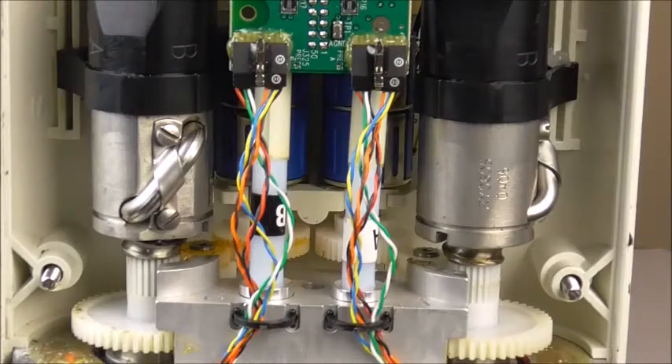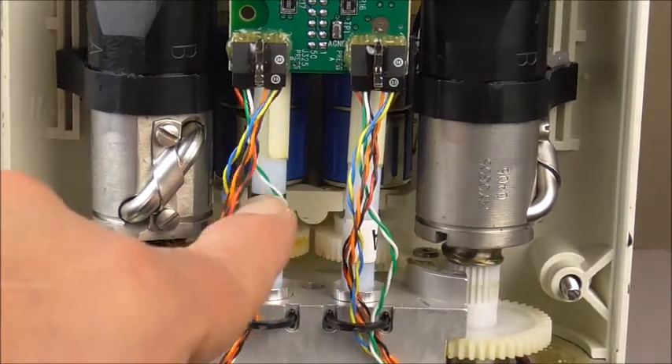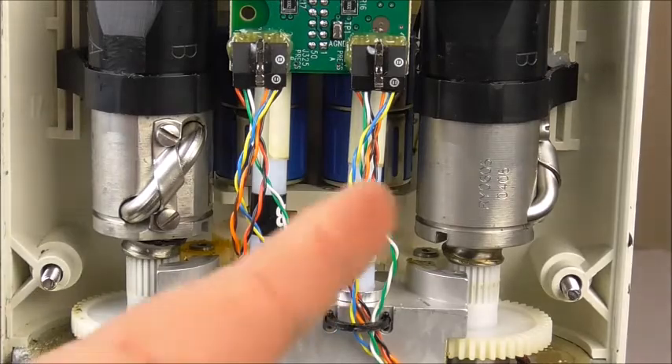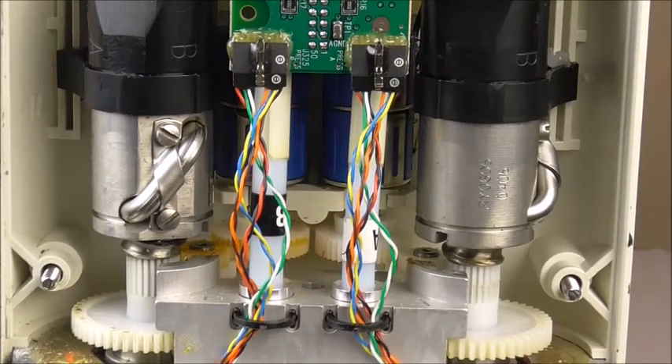Now what we're looking at right here — these are my two blue potentiometers behind my power drive cables here in the back. These two blue potentiometers are actually held in place by a clip in that bracket right here in the center that I'm pointing to. That bracket is a plastic bracket that actually holds the pots in position so they don't move around when the pistons are driving up and down.